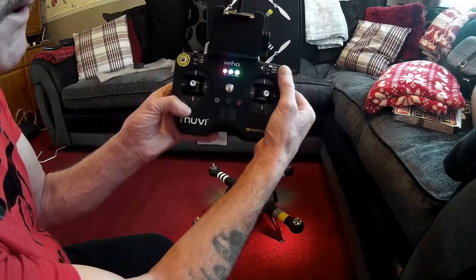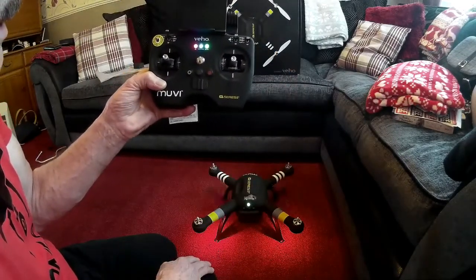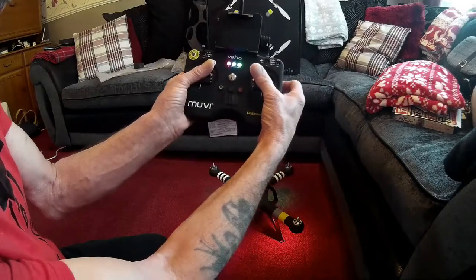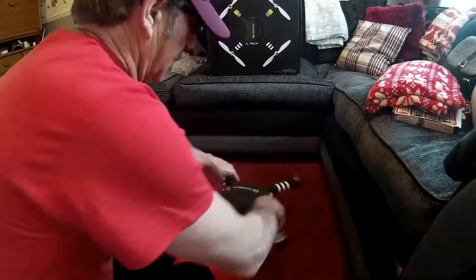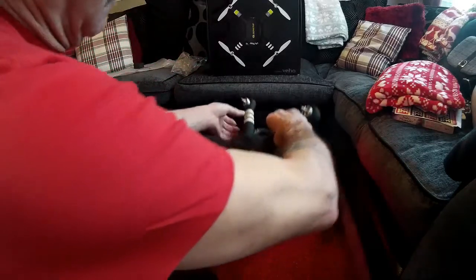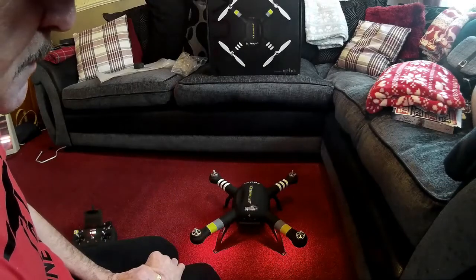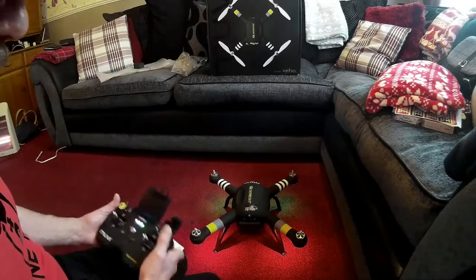The very right-hand switch — flick it five or six times up and down until the drone is flashing. Then take the two joysticks, push them upwards and inwards like that for a few seconds, and the lights on the front of the drone will start flashing green. Then rotate the drone round once that way, face it towards you, go round — now all the lights have gone off. Wait for those lights to come back on green. There they are — they come on green, so you're ready now. You've got your GPS lock.